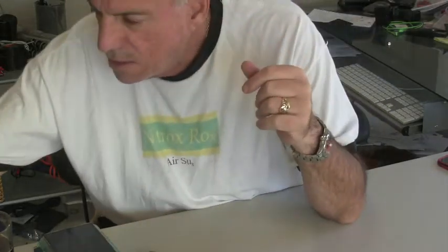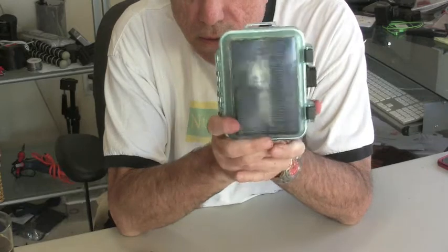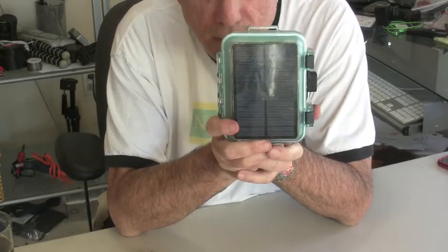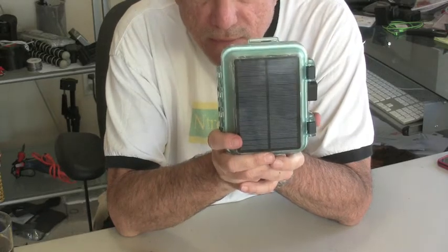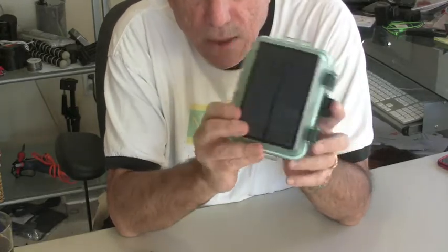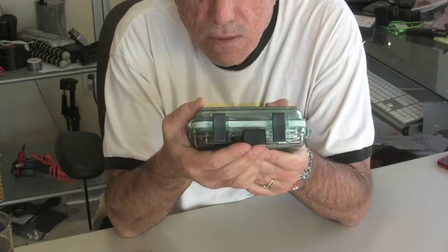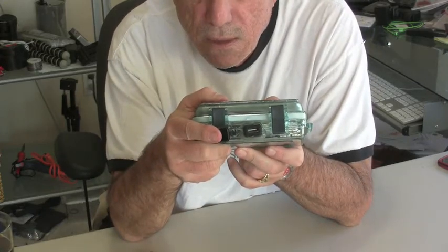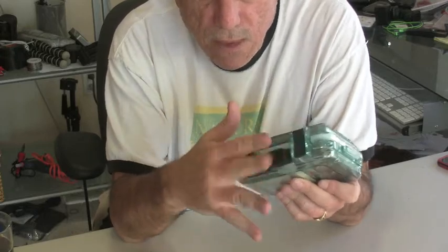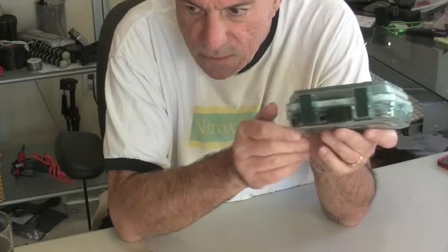So I decided to take it to the next level. Here it is. This is what I consider a complete, all-around, very portable solar generator survival kit and iPhone charger. The panel on top is again 9 volt, 1.5 watt. And there you see on the outside is the waterproof boot that I mounted in the case — the opening for the USB cable to plug in, so you can charge your USB iPhone, or GPS, anything that will charge off of a 5 volt boosted circuit.